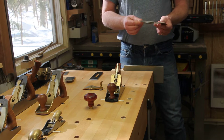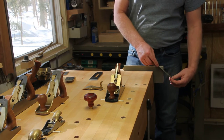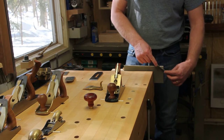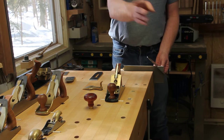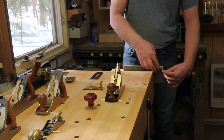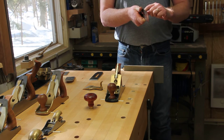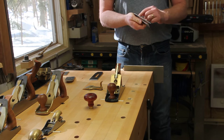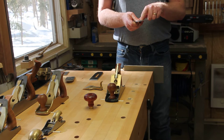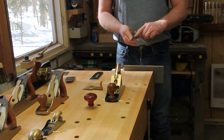To make the slot bigger, I put the slot onto my diamond flat plate like this and move it back and forth slowly — it's a slow grind back and forth. I usually do about 20 strokes per side, flip it over, 20 strokes per side. You can tell if you're grinding evenly by the striation marks on the inside of the blade. It just takes patience — it takes me about an hour to do it: hollow grind the blade, flatten the back, polish the back, and widen the slot.